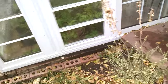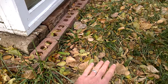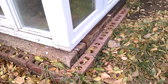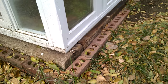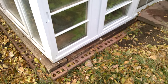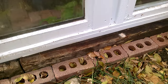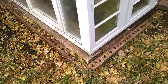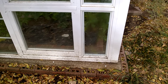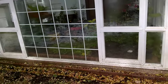From the ground up, as you can see, the bricks aren't really playing a role currently — they're something I'm working on for drainage. I'm going to get soil up to where the bricks are so there's no flooding in this low spot. The foundation is railroad ties, and these are great — they seriously last a really long time, like a hundred years. They're treated really well. These are the real genuine railroad ties, not the kind you'd get at Home Depot. You'd have to go to a place that recycles the old ties pulled from actual train tracks.